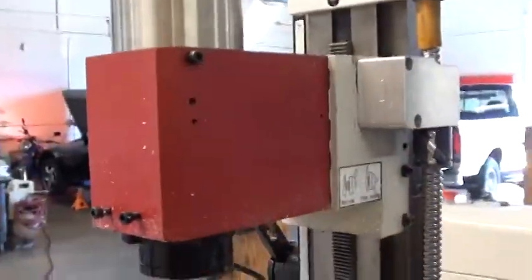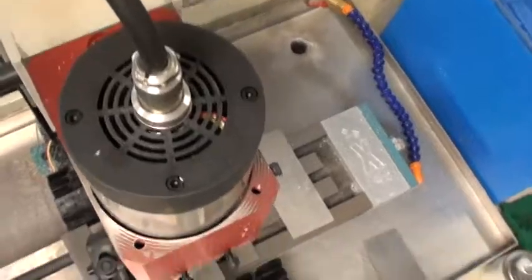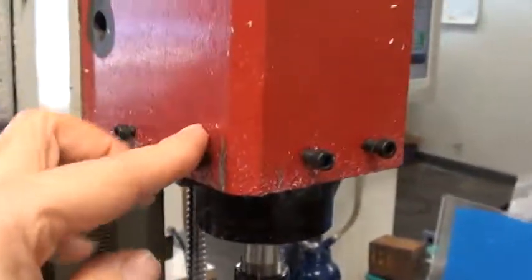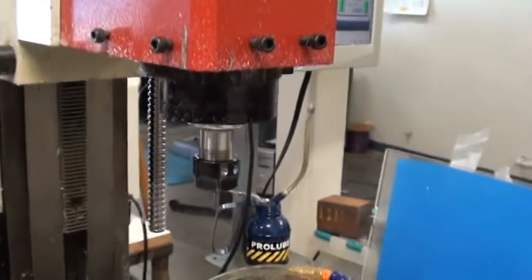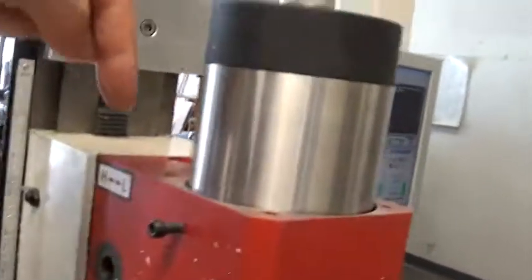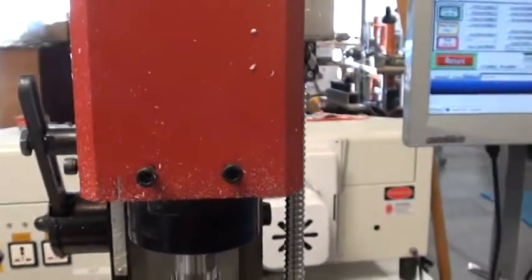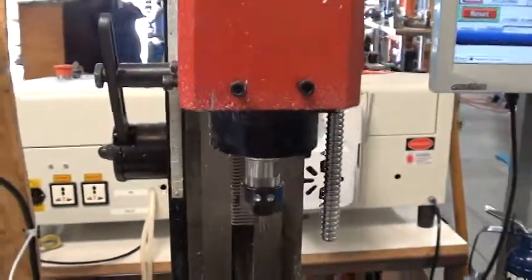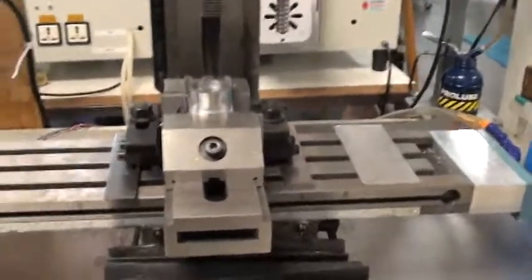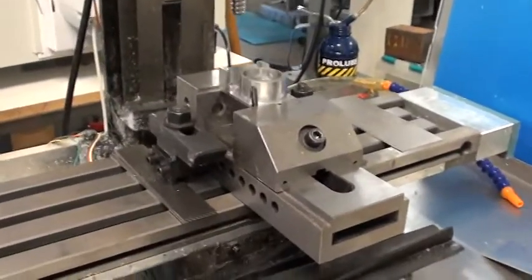The red casting was also from Little Machine Shop. I just bought the replacement part and bored out the 80-millimeter hole. That's held in with set screws, but if I was going to do some real heavy cutting on this, I would make an aluminum clamp around the nose, probably at the top as well, and bolt it down into the casting using the existing holes. I've just been doing relatively light cutting and that has not been a problem. It does a wonderful job on plastic. I found some Kyocera single flute end mills on eBay for fairly cheap — they hold up great, they just chew up the plastic, and they work pretty well in aluminum.